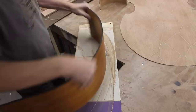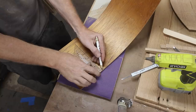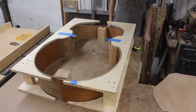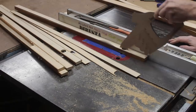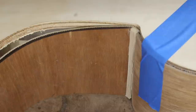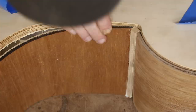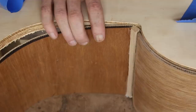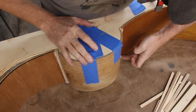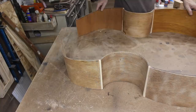I made a quick sandpaper board for sanding out the sides, long enough to reach across the whole instrument in case I need that sanding ability once it's together. Then I did some final measuring and trimming to get all my pieces ready to be glued together. I screwed the mold onto my workbench so it would not move and started preparing more wood for bracing on the interior using the trim of the hollow core doors. The corners were my biggest concern, so I decided the best thing to do was glue a piece of solid wood in there, and then filled it in with TotalBoat Thixo epoxy which cured pretty quickly so I could keep working.